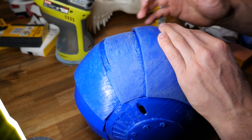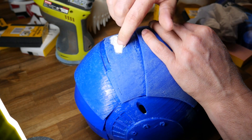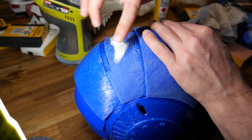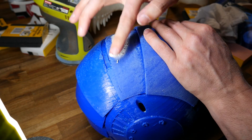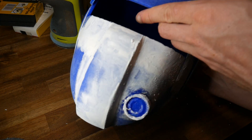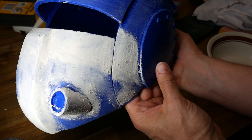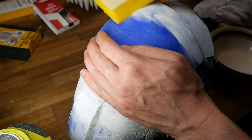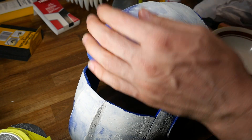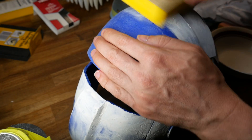After sanding around half of the surfaces, I started to use the timber putty. This stuff is really easy to use and being water-based means it's non-toxic. On something round, I like to use my finger with a bowl of water to the side to make it a little bit wetter and help it spread where needed. It didn't take too long before I'd puttied everything I'd sanded, concentrating especially on the join between the pieces I had to glue back together. Wood filler dries quite fast, sometimes only 10 minutes - because of the dust I'd still recommend wearing a mask or respirator.